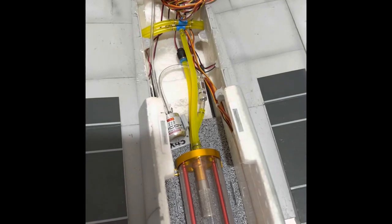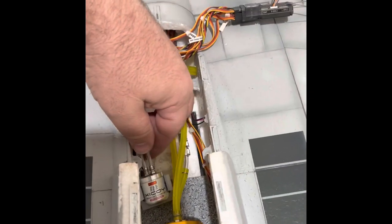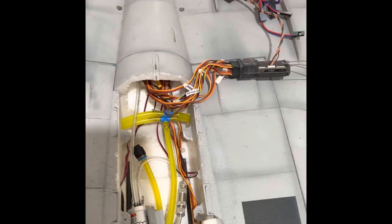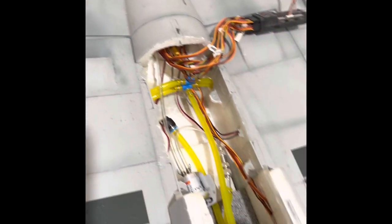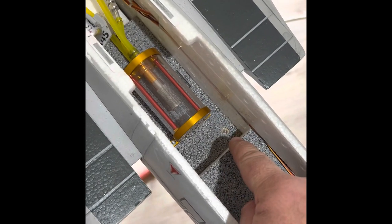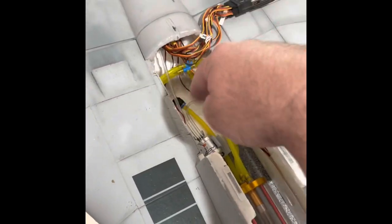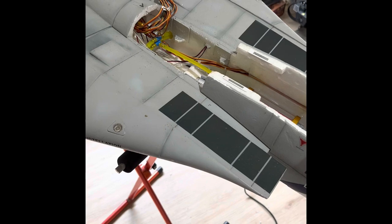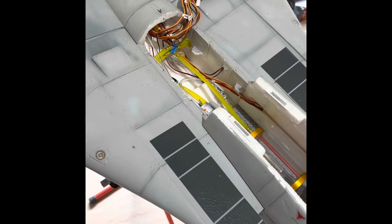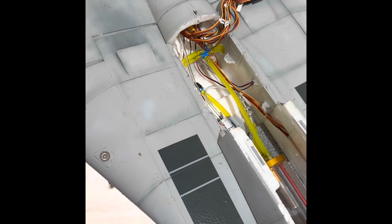The fuel system is mostly installed now. The air trap is in place and we've got the fuel filter. The pump is still loose but I've 3D printed a bracket to bolt it down and hold it in situ — it clips in quite nicely. The only thing not yet connected is the tank venting system. For that, I've turned up a vent on the lathe because it's quite a long hole through this section, and I wanted the vent sitting further forward — both so I can see it clearly when refuelling, and so I'll have a clear line from the top to see when it starts to vent to overflow. Installing the vent is the last remaining piece of the fuel system.